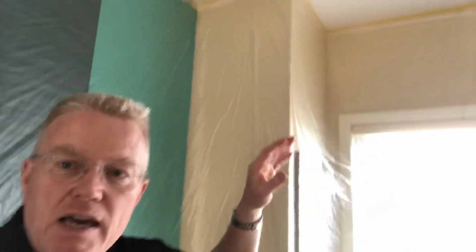Now, this paint has been on there for a while, so we don't want to run the risk of taking it off, okay? It's old paint. So I ran frog tape, the yellow one, as I embedded that into the wall all around. And then what I did after that, takes 2 people, you go around and you drape the plastic up against the yellow tape with new tape. And that is the Sherwin-Williams masking tape. You can use 1 inch. I happen to use 1.5 inches.